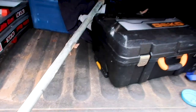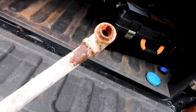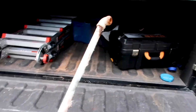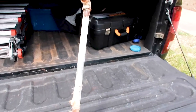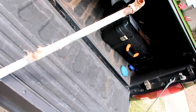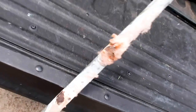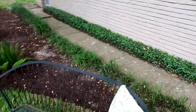This is the pipe I pulled out of the attic space. This is that electrolysis I was talking about — where the water lines break down from the inside out, creating pinholes, becoming very brittle, and causing water leaks in your attic space. This goes into my inspection pile of treasures — I collect this stuff so I can show agents and home buyers what we're actually talking about when we mention galvanized water lines and how they're going out across the city.